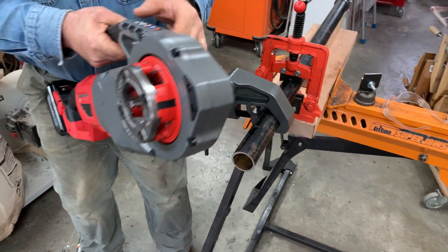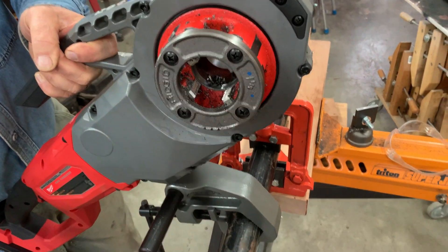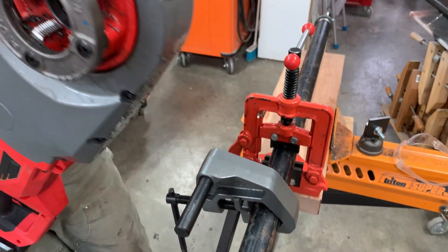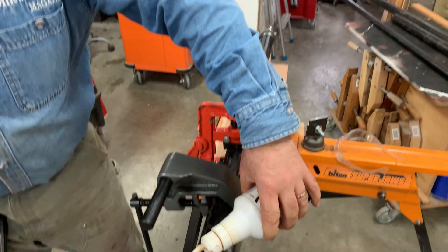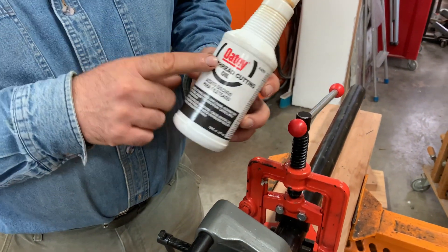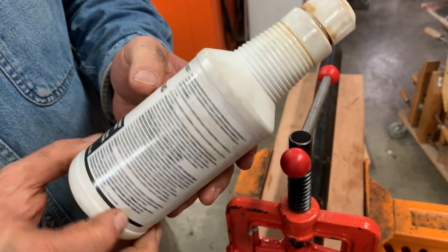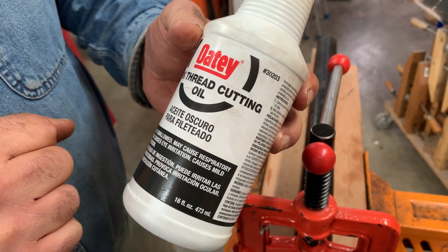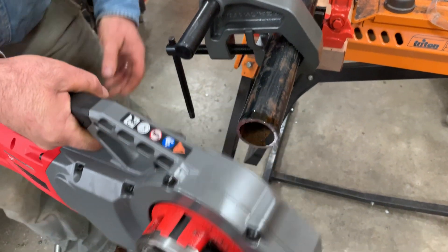It's going to revolve and basically peel out ribbons of metal, cutting the threads into the end of this pipe. Now in order for this to work properly we need to use the right kind of cutting oil — not just any oil, but actual cutting oil makes a big difference. I've used a few different kinds and so far this dark cutting oil is the best. It's especially meant for cutting threads, and it works great. I'm going to be putting a lot more on than this, but this will get me going.